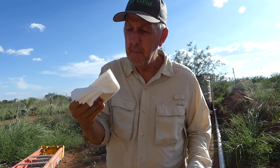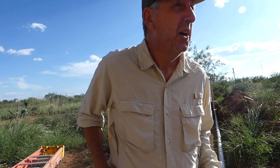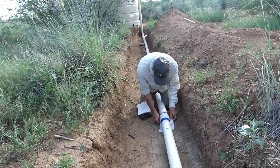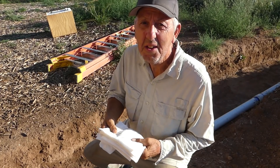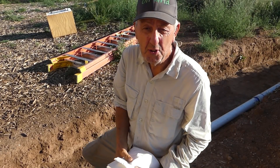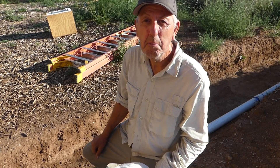So now the plan is I'm going to dig underneath every one of these joints of this PVC and just put a paper napkin under each one, then leave it for a couple of hours. It doesn't look like it's going to rain for the next hour or so, though you never know here — it can happen pretty fast. That way, before I end up burying these big lengths of pipe, I can feel confident that there are no leaks in my gluing job. And as you can see, these are all beautifully bone dry — meaning there are no leaks in the schedule 40 PVC pipe that I glued together.